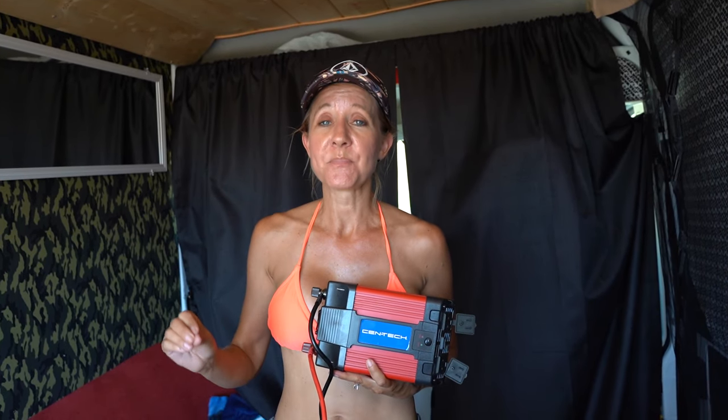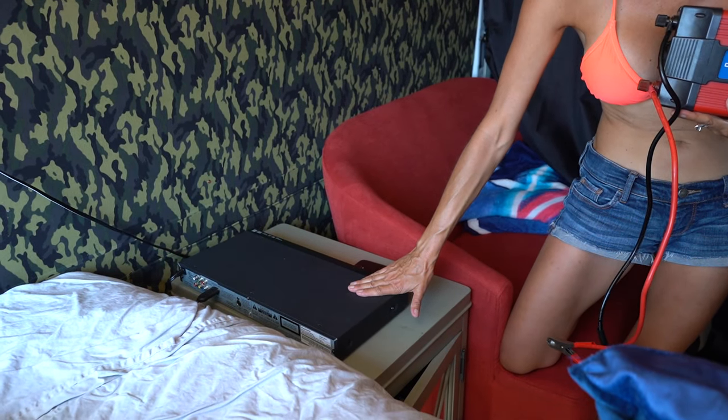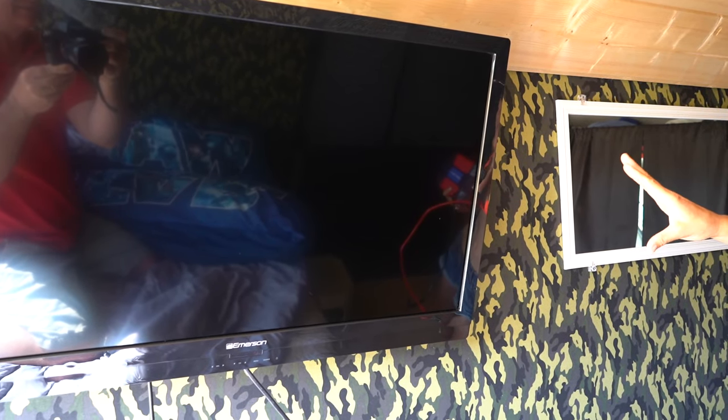The battery I'm using connected to the solar panels is a 420 watt battery — it is a 35 amp hour battery. You multiply that times 12 volts which gives you 420 watts that you can use in an hour. However, for a battery you only want to drain it approximately 50%, so that really only gives you 210 available watts per hour. When I'm running my inverter it's approximately 10 watts, my DVD player is approximately 10 watts, and my television is approximately 80 watts.